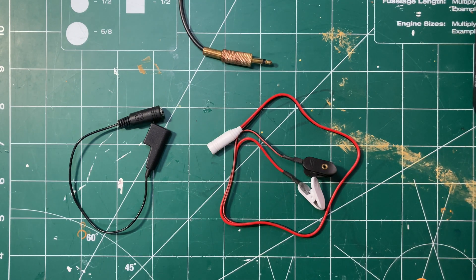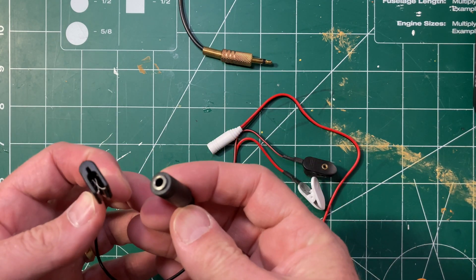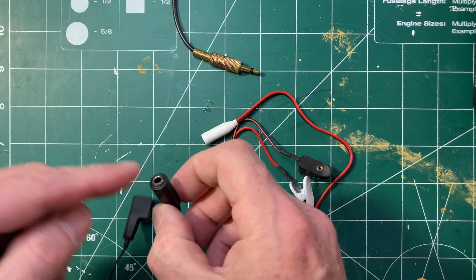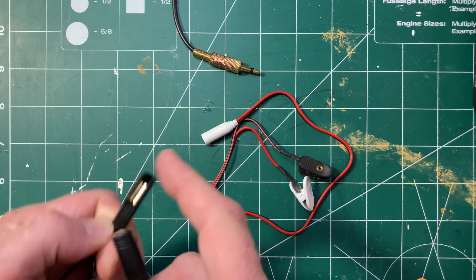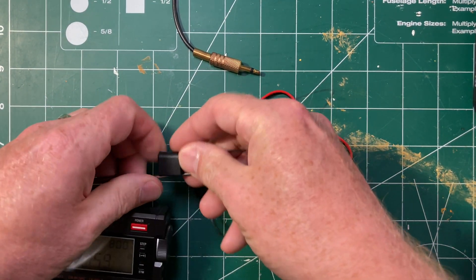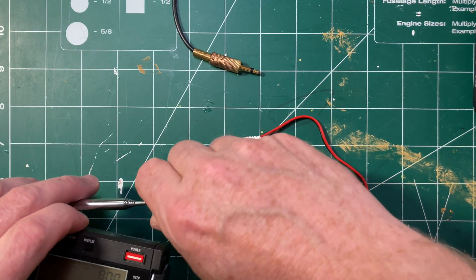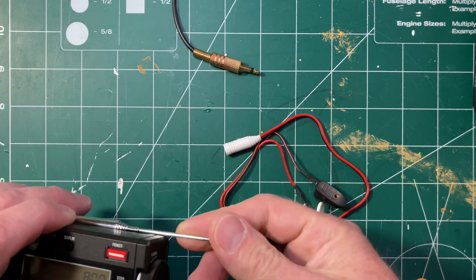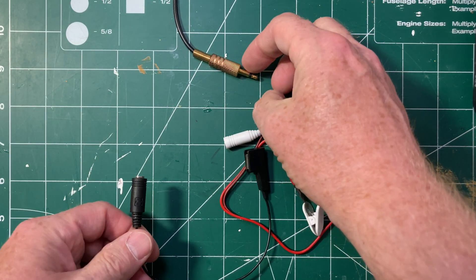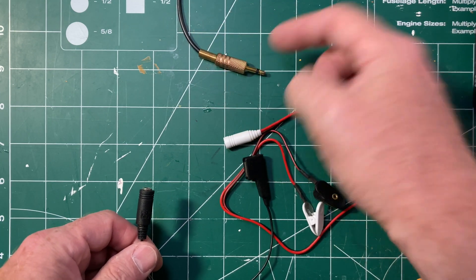So what do you do? Many real antennas come with these little adapters which take the center conductor from the plug and connect it through to a little clip, which you clip over the antenna — like so. Problem solved. Or a lot of people use alligator clips or whatnot. But the problem with that is it's only taking the center conductor; the shield on the coax is not connected.